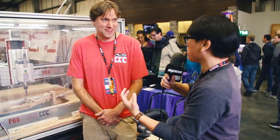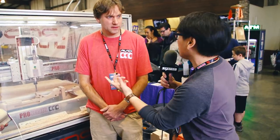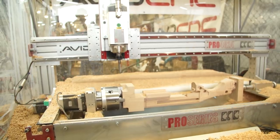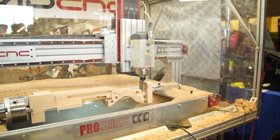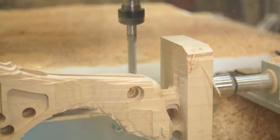One of the things that really impressed us as we put together the big three axis one — how big it was scaled up to be — the big gantry fits full four by eight sheets, but also how rock solid the design of it was. There's been a significant amount of effort that's gone into making this the robust system we really wanted it to be. We've had customers do third-party rotary systems in the past, but they're really not strong enough to hold the part well or to resist the cutting loads. We're routing solid maple on this, taking quarter-inch passes at about 400 inches a minute, so we needed a really robust mechanism.